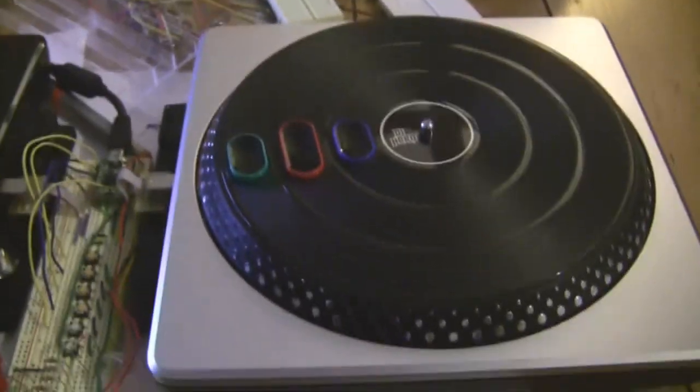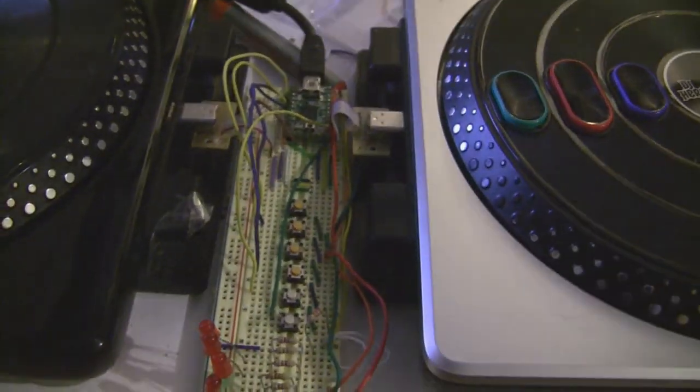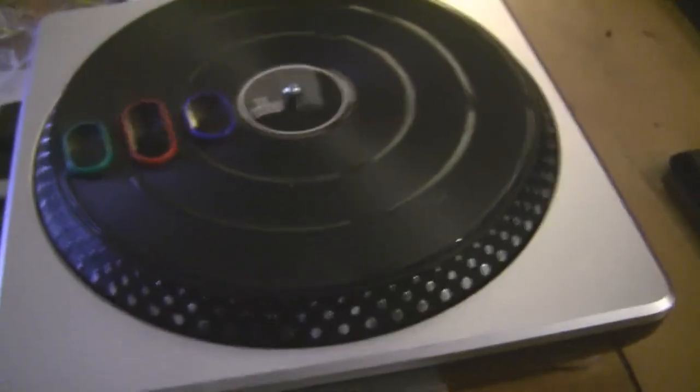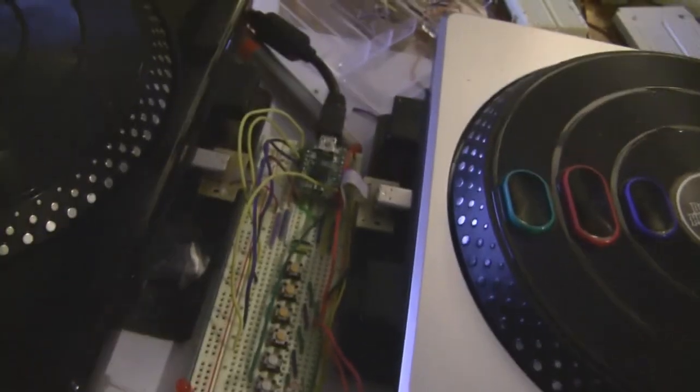If you don't know what an I2C bus is, go look it up on Wikipedia or something. This video is going to be here for quite a while, hopefully. So what happens is this turntable — because it doesn't have that little switch pressed right there — IDs at I2C address 13. This one IDs at I2C address 14. And this little guy polls both of them as the master I2C device, then sends it over to the computer as a generic USB HID device.